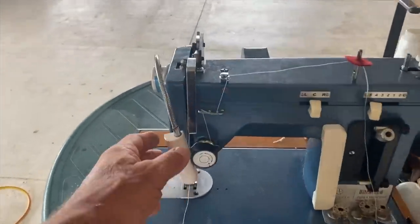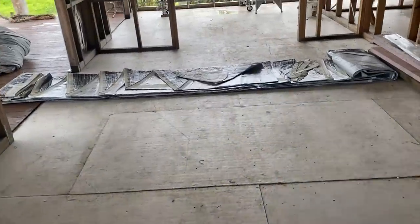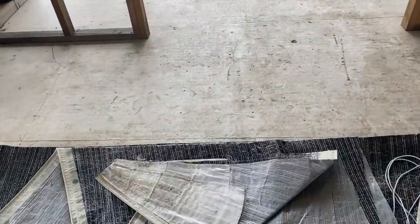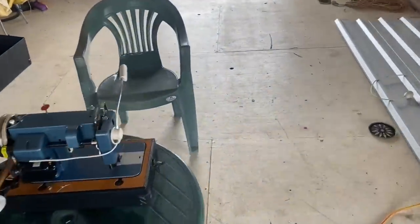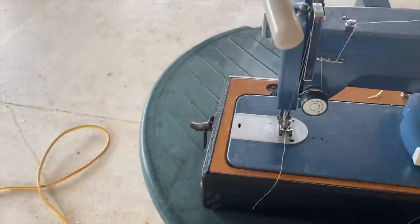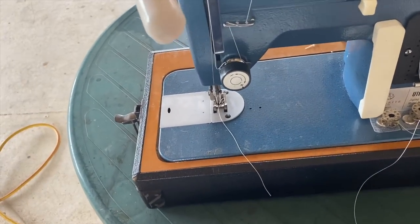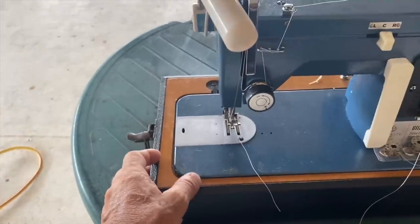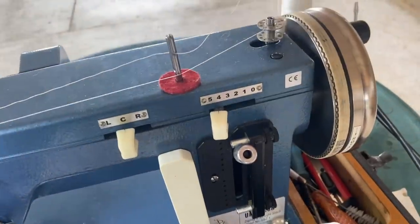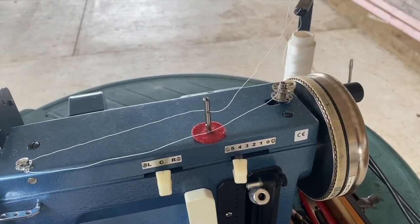Another day again to sew. The second sail is all ready. The last two days I had a problem — I finished all my needles because I broke them all, and also lost the timing of the machine — the hook never caught the lower thread. But after I worked on the regulation, I found the correct timing. Today I want to work non-stop; I need to prepare all the bobbins of thread and have rolls ready.